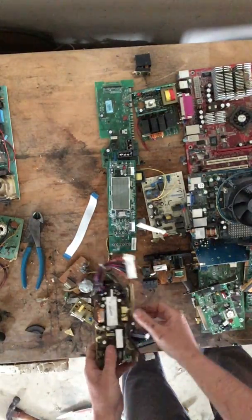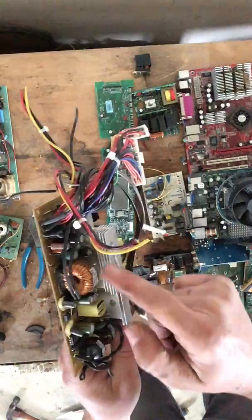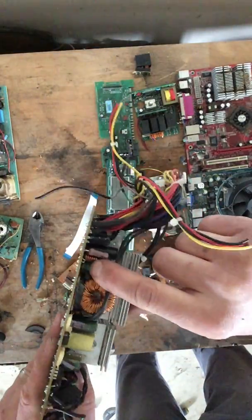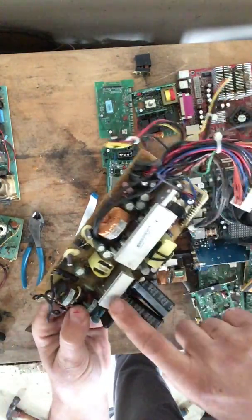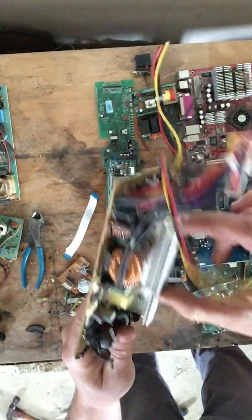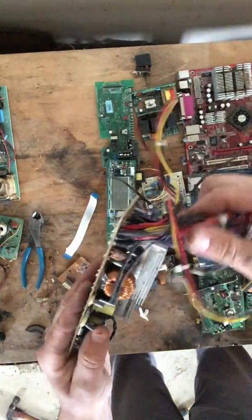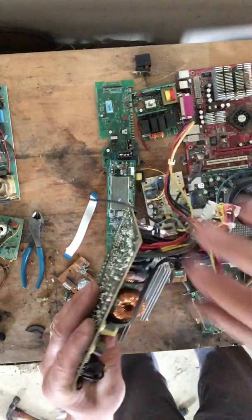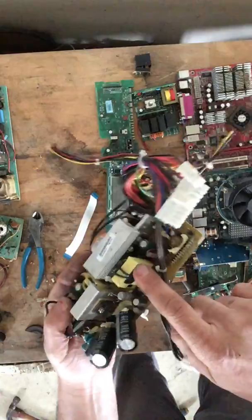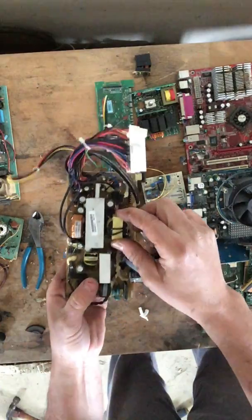Here's another lower-grade board — again no gold, but there's a really nice copper spool. Some coated copper would be number two. There are a couple of aluminum heat sinks; I take these off because aluminum is worth about 50 cents a pound, whereas with lower-grade boards I'm getting something like three or four cents a pound. The insulated wire goes for about 20 cents a pound — I find I get a lot more money by separating these. There's also a transformer — it's very thin with a lot of paper in there — I might just leave this one on for weight, but there is a separate bin for transformers.